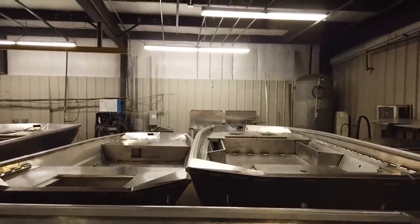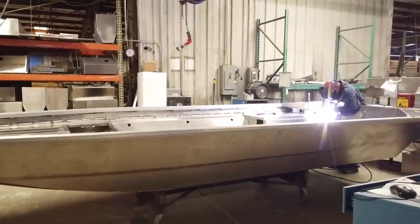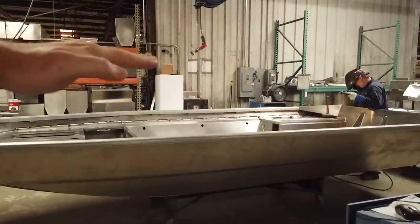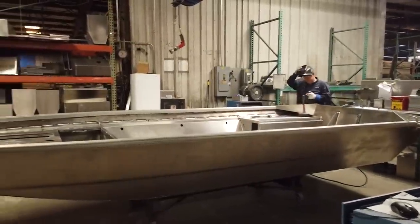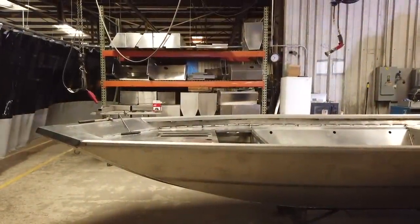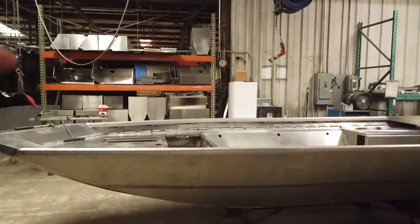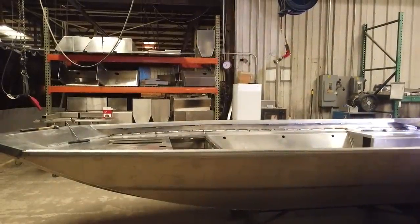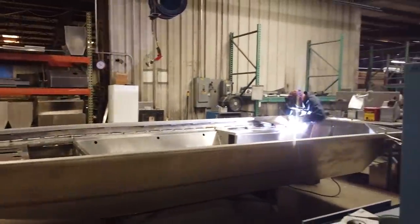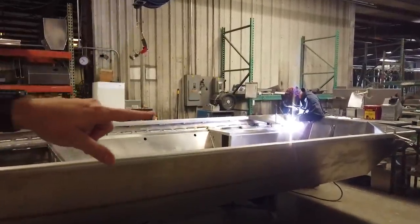That's a big boat — that's a 2072 bay. He's doing the cap-out, which is all the finish work. He's putting all the side caps on, finishing that off, marrying the top cap and front end piece with TIG welds. I want to get some pictures of his welds — he has been doing this for over 30 years. You can look at some of the beads he does.